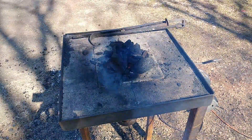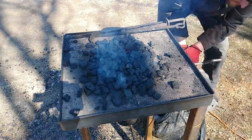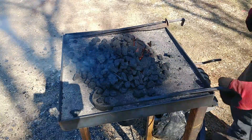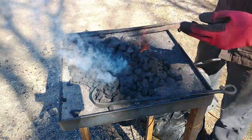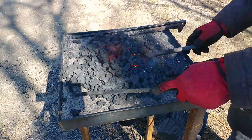Now this first part that I'm laying on: you can hang up your hat trying to get coke lit with just paper towel. You really need some charcoal or kindling to get a good coke fire started — at least that's been my experience. And this is one of my most favorite types of fuels to work with: metallurgical grade coke, if I can get it.